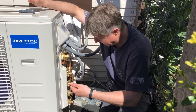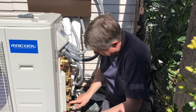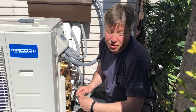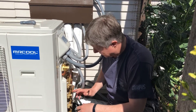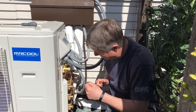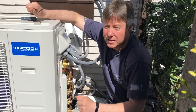What we'll do is get some dish washing soap — either in a squirt bottle or with a small paintbrush — and dab it on the connections on this side and at the air handler side. Just dab it onto the connections and check for leaks. You shouldn't have any because it's double sealed with two o-rings, but it's just a safety check. Go through and check each one using your paintbrush or spray bottle, and also check any line set coupler connections.